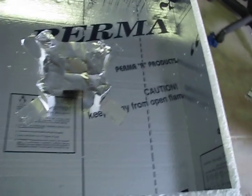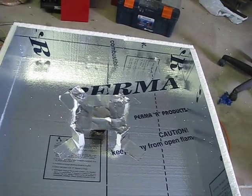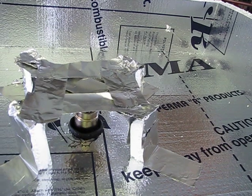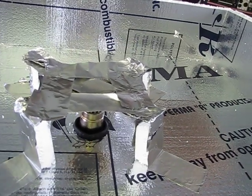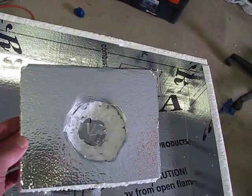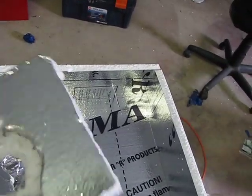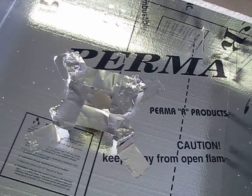Here's my oven that I've got built. I built this square frame out of styrofoam insulation. The heat gun comes through the bottom — you can see it there — that's what I'm gonna heat this with. There's a shield because I don't want all that heat to go right up and hit directly on the solar panel; it'd get a really hot spot and melt the plastic. I found out the styrofoam isn't heat resistant — it melted a hole right through it. This isn't tin foil, it's plastic, so it melts pretty easily. So I put some tin foil tape on there, the same stuff I tape this box up with.